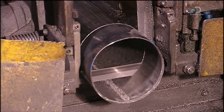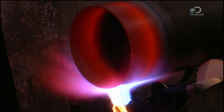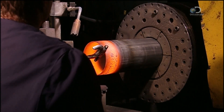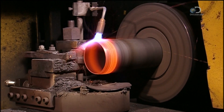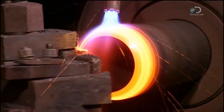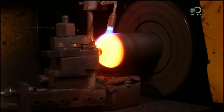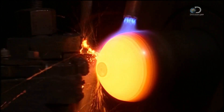A bandsaw now slices up to 10 centimetres off the other end, which will become the top of the cylinder. A torch heats that end to 982 degrees Celsius for 90 seconds. In a process called hot spinning, the cylinder is placed in a device that spins at 1000 RPM. As a torch maintains the temperature, the machine shapes the edges of the searing hot metal into a curve, gradually closing off the top end and shaping two rounded areas called the shoulder and neck. Making these areas curved is the best way to contain pressurised gases — curves spread out the stress on the metal, whereas a sharp corner would focus stress in one spot. The only exit for gases will be through a valve at the top.